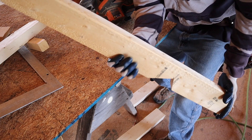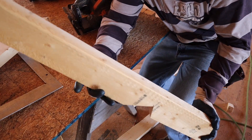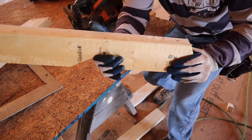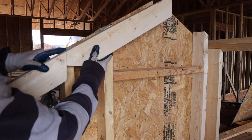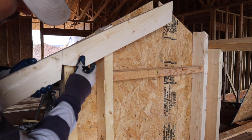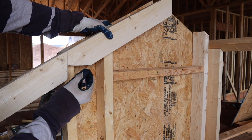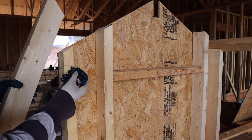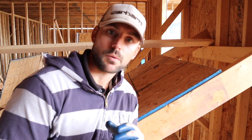You can see what we've got here: this end goes up against the two-by-four ridge board, this will sit on the wall we're going to build, and this is our overhang. The reason I built the rafter first is so you can set it up flush where the roof's going to be, put your seat cut and heel cut right where it's going to be actually installed, hold it really secure, and scribe your line. That gives you the height of the wall you've got to build to hold your rafters.